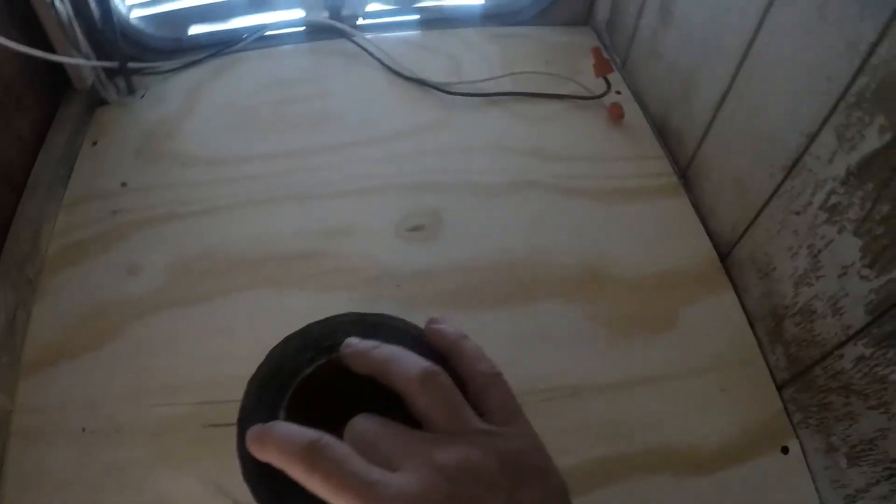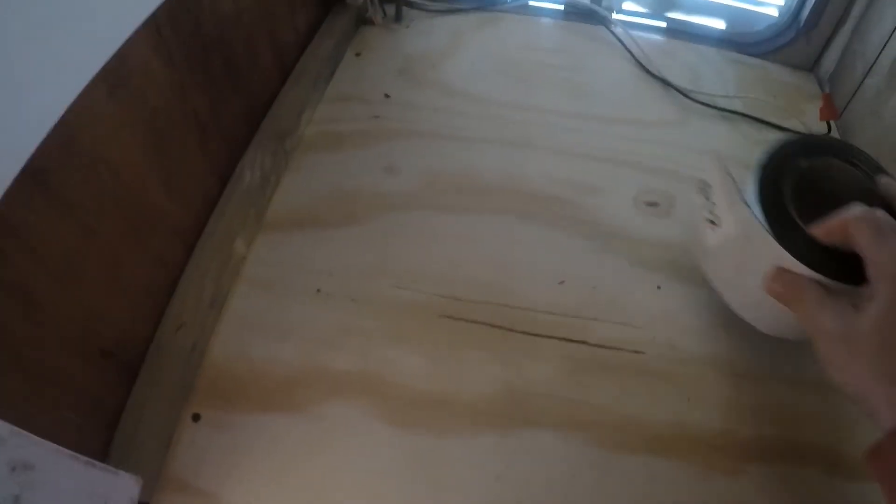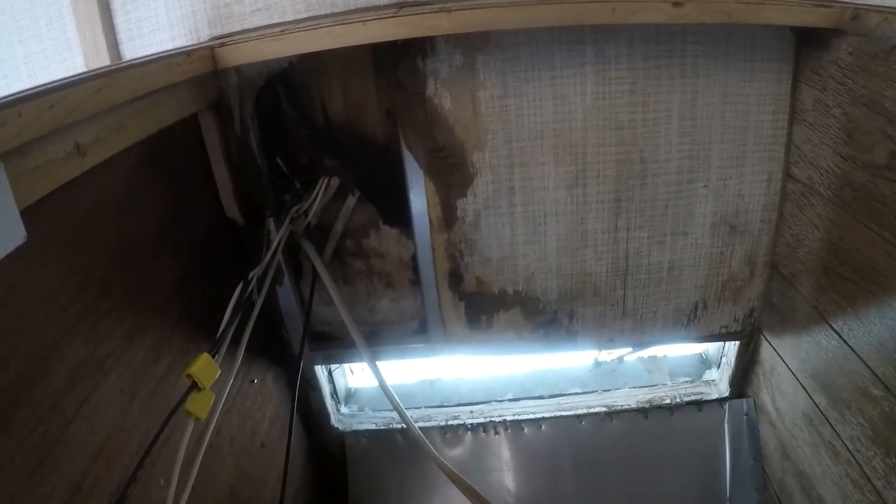You can see I put in the new plywood — cut it square. Apparently the opening is not square because there's a gap here and there, so everything's kind of skewed to one side a little bit. I'm going to seal this up and use some of this product to do the edges like flashing when I get the panel up. I'm also going to insulate these gaps and put another layer on here in order to make it punch out where I need to.